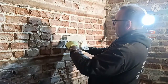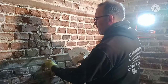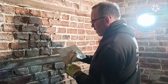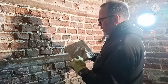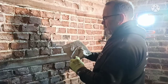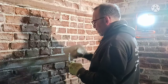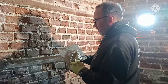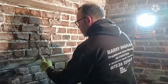So, your board is like that, okay? I'm going to take that much and put it in that part there. As soon as I grab that load, I pull the hawk, yeah? I don't tend to push the point. If you look, the actual hawk is moving. It's only when I'm working on the edge like that that I don't bother pulling it, because I know it's there. But I'm working up the hawk. I'm in. That's the trick.